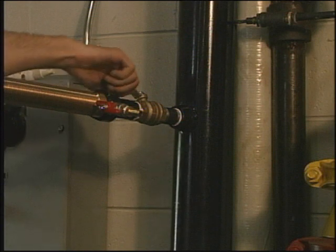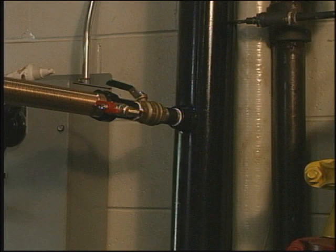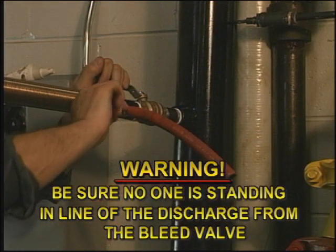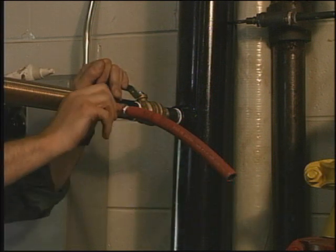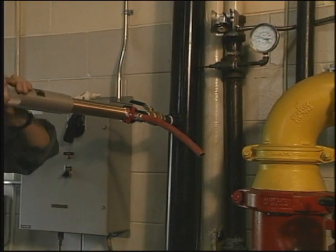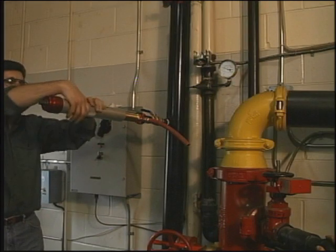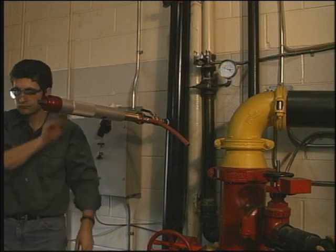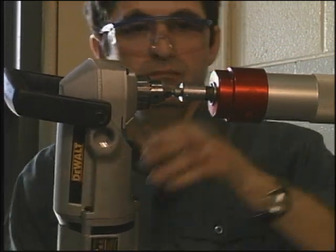Open the valve. When the bleed-off valve is used, a hose may be connected to it to help direct the discharge. Warning: be sure no one is standing in line of the discharge from the bleed valve in the event of accidental opening. Turn the sleeve clockwise until the pilot drill comes into light contact with the main, then back the sleeve up one turn. Using the ratchet wrench or a power tool, rotate the drive shaft at the 11/16-inch hex while continually applying pressure by turning the sleeve.